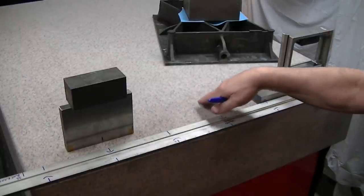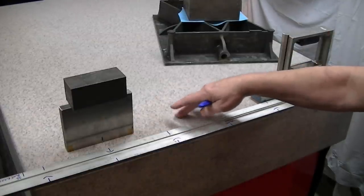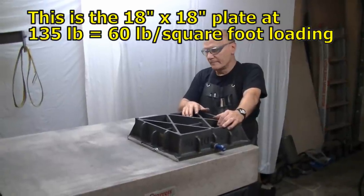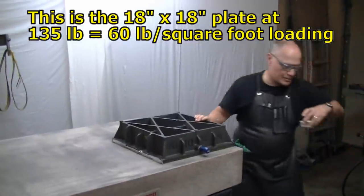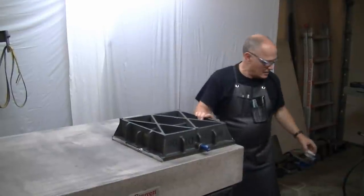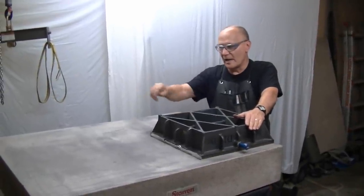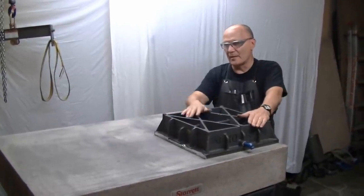It's a little bit hard to clean. It's not like it's horrible, and maybe a lot of plates probably are this finish as is, but I definitely want to get the finish a lot better. So I have the aluminum foil on the plate. I have the 1200 mesh, which is roughly 10 to 16 micron diamond powder, rolled into the plate. I sprinkled a very light layer of the diamond powder and brushed it out, and then set the plate down on it. And I'm taking a lap around there.